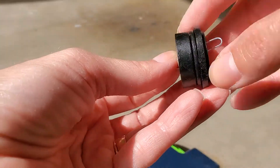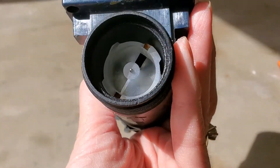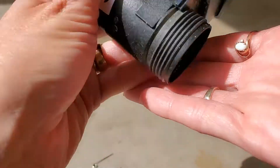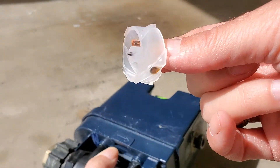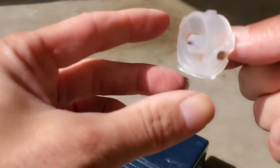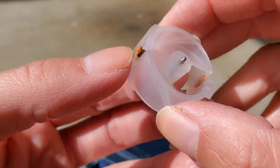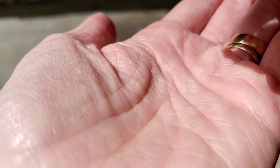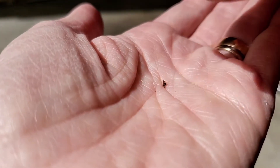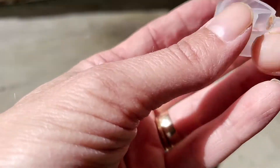So we have this outside protector piece — it's like an O-ring right there. And the turbine does not just fall out. You can see there is buildup on these magnetic pieces, which send signals back into the flow sensor. As this spins, of course, it's going to send those signals back and give you the flow of water — how fast the water is flowing through the turbine.